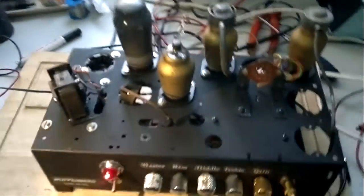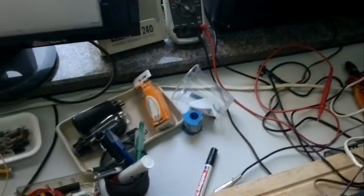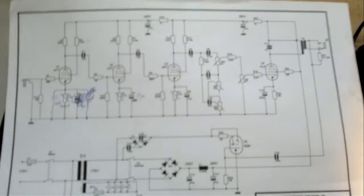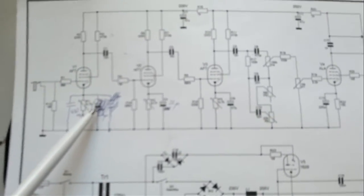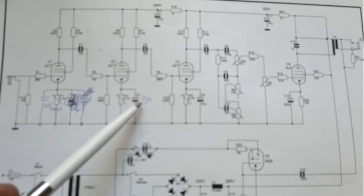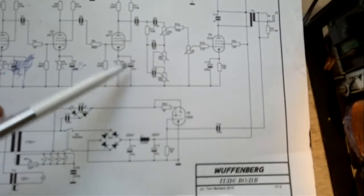I made a stellar breakthrough with the sound — the muddiness is really gone. I made a circuit diagram and mainly what I changed is around these cathode bypass capacitors. Initially they had 2.2 microfarad, and that was still too much. Finally I changed it down to 470 nanofarad. I tried even higher values, but it's also 470 nanofarad only on the second gain stage.